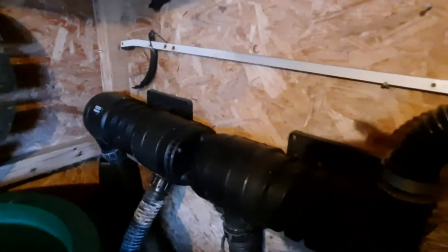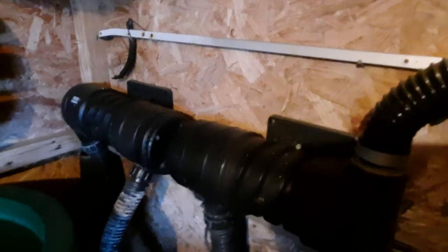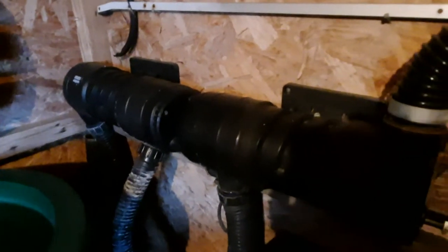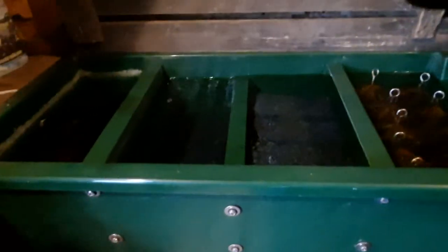There are two UV lights in there. Water is being pumped from the pond up through two UV lights, and one of them then goes around to this smaller filter here — this one actually filters out finer particles than what the bigger filter does. The bigger one takes larger debris, though a lot of the big debris goes into the circulation pot.